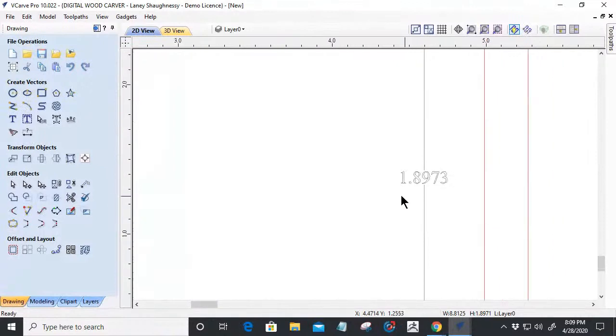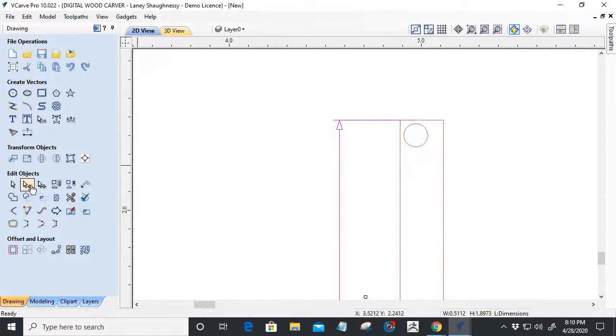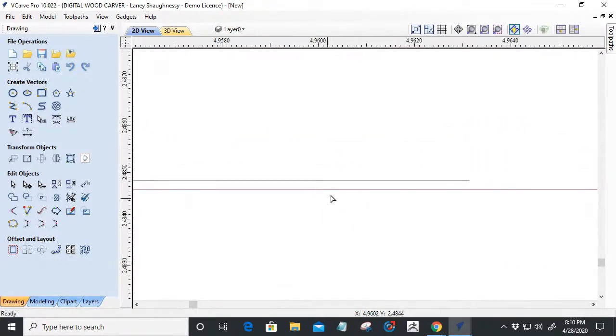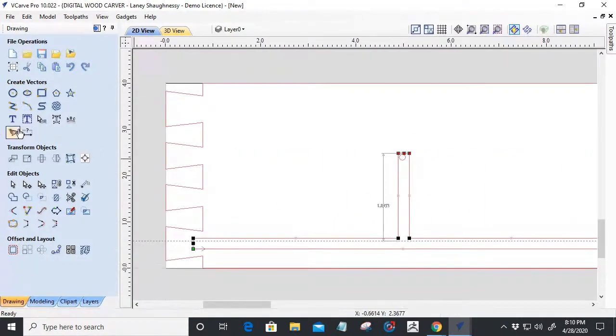So I only need to move 0.0002. Okay, so if I come in here, grab this part, go into node editing, select on it, insert a point right there, select all three of these, and start pulling them down straight. Make sure you go straight. Don't get all wonky and everything. Pull them straight down, and I can go ahead and type in my 0.0002. Hit enter. And man, it moved ever so much. Holy camoly, just that little bit. But let's go ahead and take another measurement.